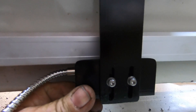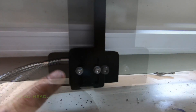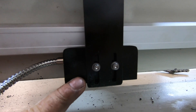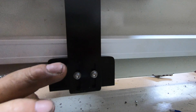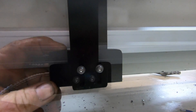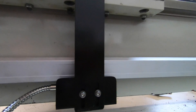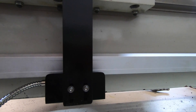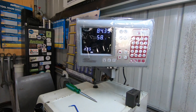You can see a bit of flex there — the scale is not touching anywhere. I used an angle box on this bracket, got it absolutely dead level — everything's level to the bed of the lathe. Everything's stitched up tight. I've got the holes drilled for the cover, so I'll get that on and then sort out the cable management.